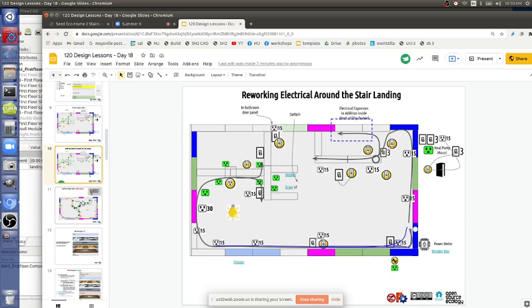Actually there is an outlet there - that's useful. Now how do we do that? The reason I wanted a board down there is for weather infiltration - wind. But the utility channel the way it's designed, it's always got the insulation on the inside and then the wires are in front of it. It's not covered up outside of the final trim closure. So by that design, if we want to put that box in, we leave the bottom open like everywhere else and then do a specialized closure.